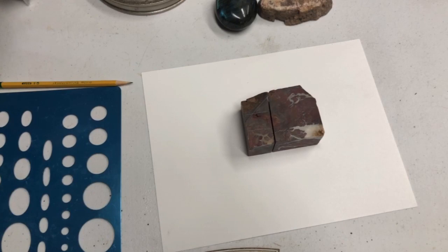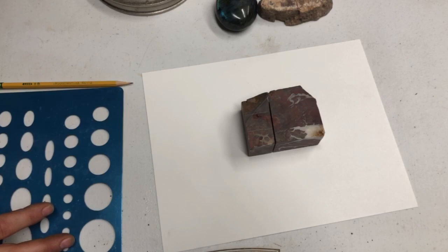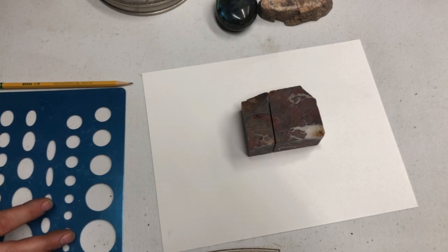I try to make a wide variety of different cuts so that I can keep the shaping machine operational for as long as possible. For me, it doesn't make a lot of sense to cut one piece, then go downstairs, put it on the PT8 and trim off the excess and smooth things out, and then go cut another piece. I would rather cut 20 pieces and then run 20 pieces all at once on the SM1, the shaping machine, and then take it back down to the production trim saw and trim and smooth the edges, and then it's ready for tumbler.